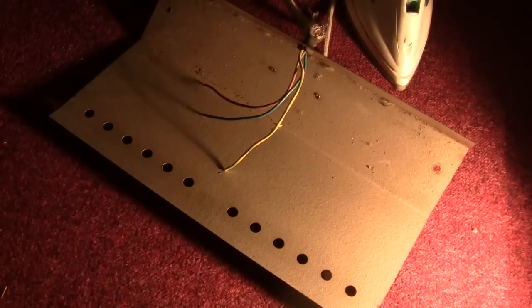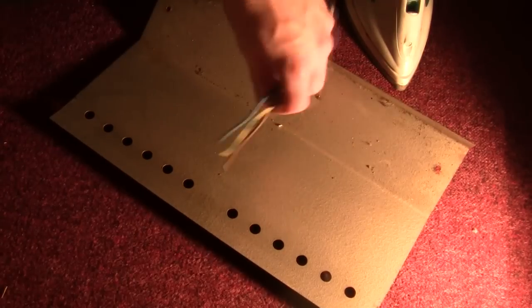Just a quick look at the internals of the unit. We've got these little bus bars — the top one is ground, the one underneath is live, and down there is the neutral, and again ground on top. There are little ceramic spacers in between so they don't short out. It's going to be imperative that you ground the unit — one little fault in there and the whole unit will become live.